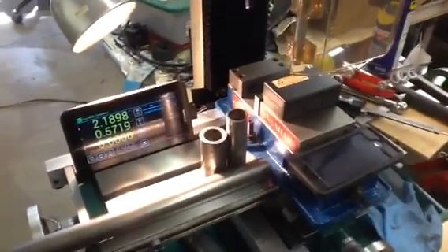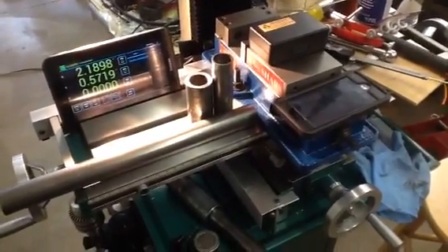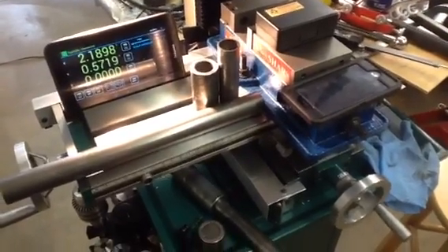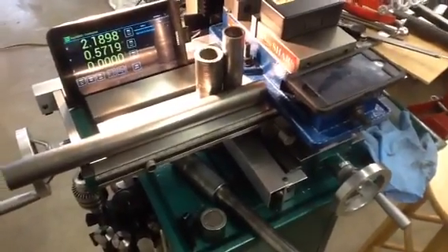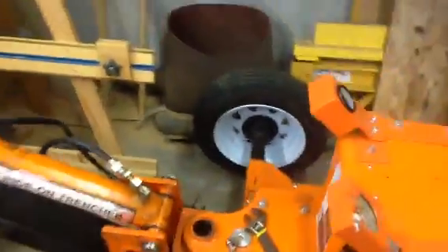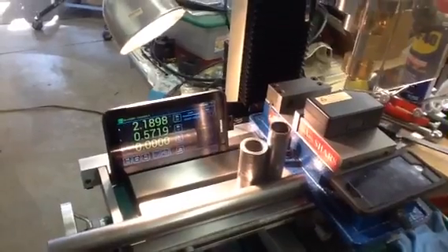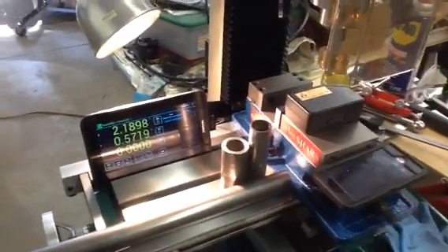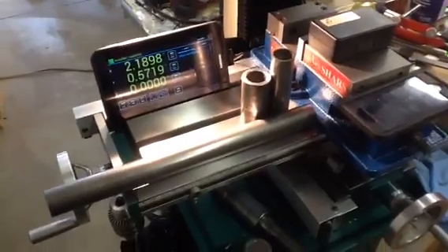It's February and this machine is going out the door by April 1st. I hope you guys heed this notice and keep a real close eye on that pivot pin. Because if you damage the actual body of the machine — if you damage those parts up in there — it's going to make it a real bitch to get functioning again properly. You're going to have to mill it out or bore it out and then put bushings in. You don't want to do that, so stay up with your maintenance. If you have to build one, build it a little beefier so it lasts.